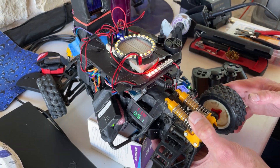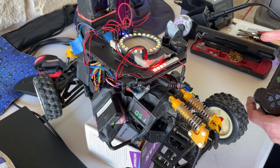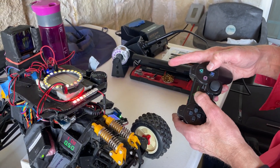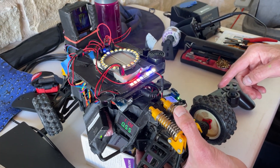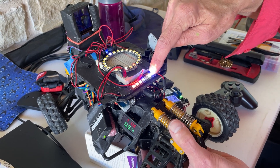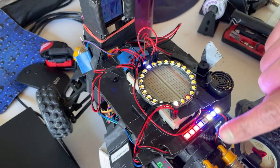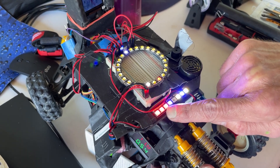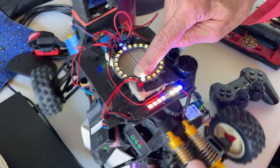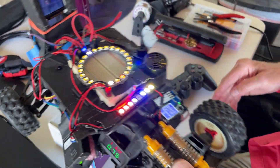The serial port from the OpenMV goes down to the Mega. Starting Robo Columbus mode — no motors, servo only — the robot has a BNO055 IMU. In this mode, when no cone is detected the PID loop is on. The IMU isn't calibrated right now, but you can see the white light indicating compass north. As I rotate the robot away from its starting heading, the steering servo tries to keep it going forward.